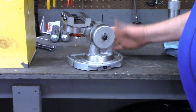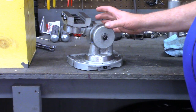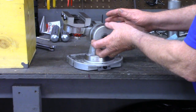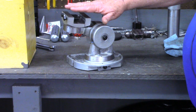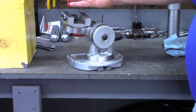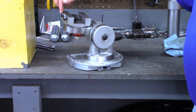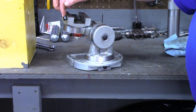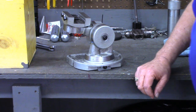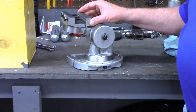This is mounted on the surface grinder — you could use it on the mill but there's a lot of opportunity for flex there. You can adjust it in the X axis, the Y axis, and the jaw itself in a third axis. I had a piece I was going to put in and mill a 45-degree angle on, and the three bolts tighten it up. I'd tighten one, snug it, go to the second, go to the third, go back to the first and it'd be loose. Went through that several times, and then I saw what was happening — the jaw was breaking off. The jaw completely broke off.